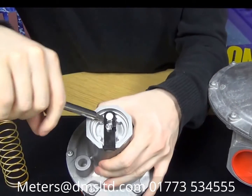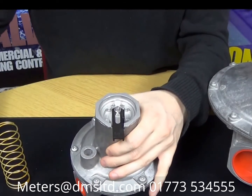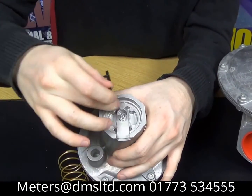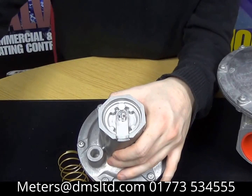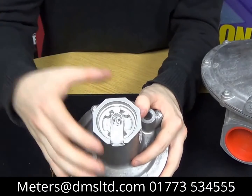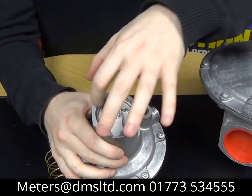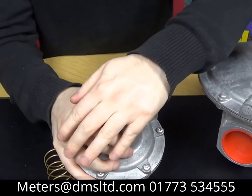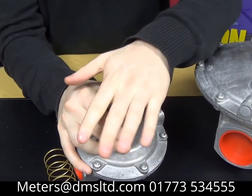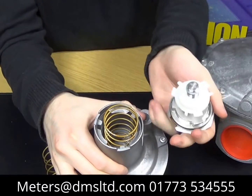Spin it around this way, pick it up, and there we go — very simple. Once we've moved it to this position, the loop is then big enough to get over this nut in the middle. We'll just put that to one side. So now we're left with this arrangement and we've got to get inside to the actual regulator to the spring. The way this works is this hexagonal top — it's actually an octagon — and it is screwable so we can twist it. If we twist it anti-clockwise as we face it, as far as we can, it then loosens up inside. Give it a lift and it will come apart like so.